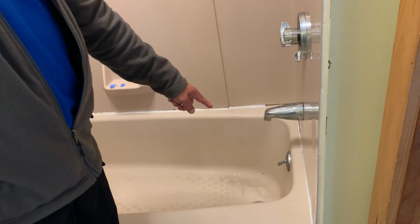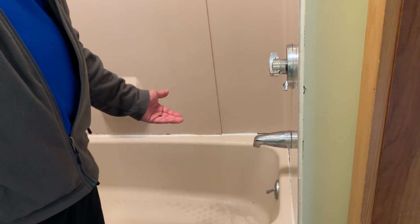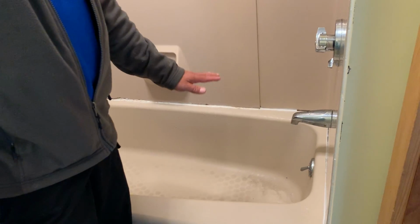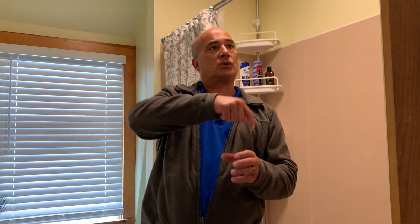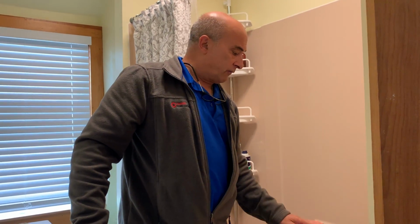So then in here, you're going to block that drain. You're going to fill it up, and you're going to watch it drain. And you're going to see if it drains properly. A good full tub is good. I don't expect you to fill it to the very brim, but a good half, because you want to watch it and see how that swirl, that suction goes down to see if it's working well. Just a little bit of water isn't enough. Okay, so fill it up.